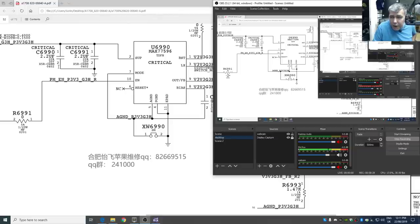2.2 microfarad, 35 volts. Now listen to me, you don't have 35 volts on this laptop. That's insane. So it's not like you reached the max voltage of this capacitor and the capacitor went shorted. No. Bad quality component, yeah. Even for a normal laptop, if I take any laptop, you find shorted caps and say, okay, that's normal. It's not normal. It's a capacitor. It's not like a semiconductor died. I don't know, too much pressure on it. No, it's just a capacitor. It's insane.